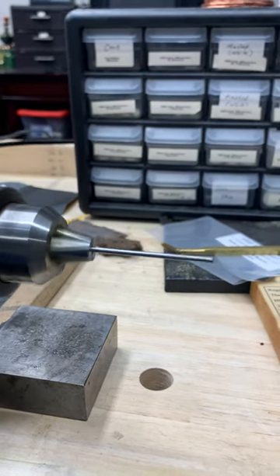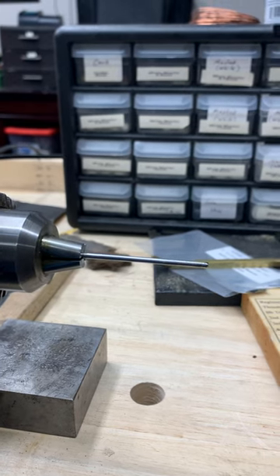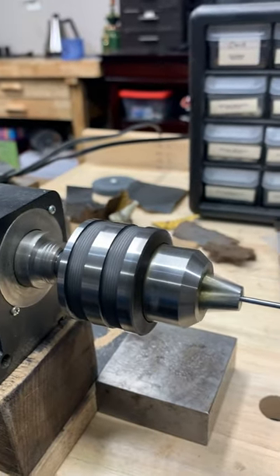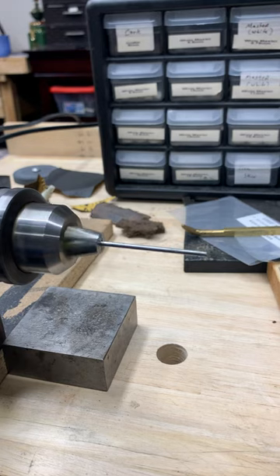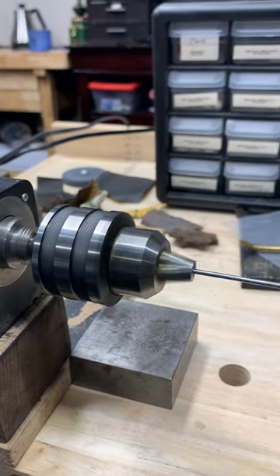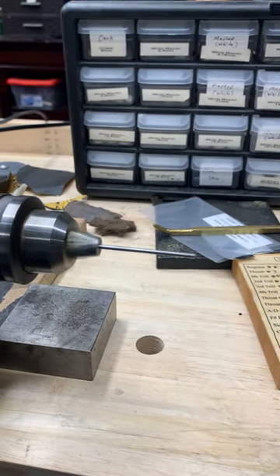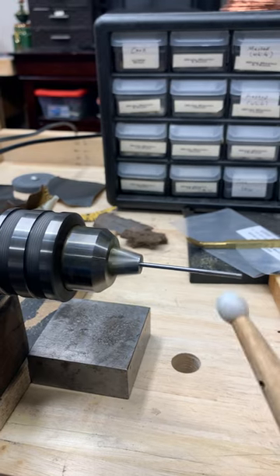Speed it up and you can kind of see it moving around. You can really see it when it's slower — you see that wobbling. When you're putting something in a bench motor, the motor needs to spin true. There are different tests you can do to check how accurate your bench motor is, because you need it to spin true — the bearings, everything that makes up your machine. You want everything to be as true as possible, and because of that, when the rod is spinning it's constantly trying to find center, which is why you're seeing this wobble.